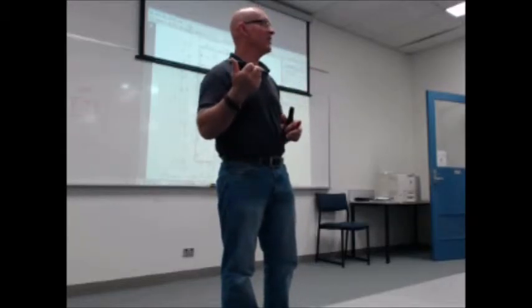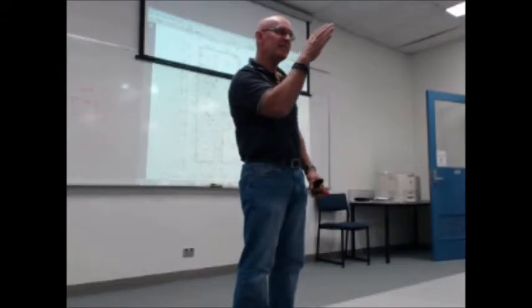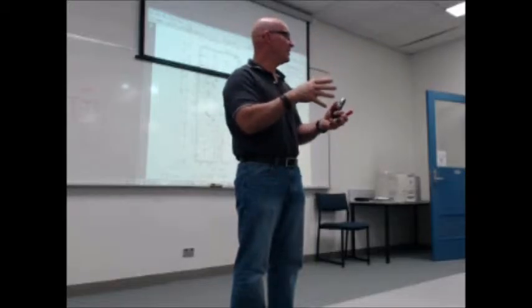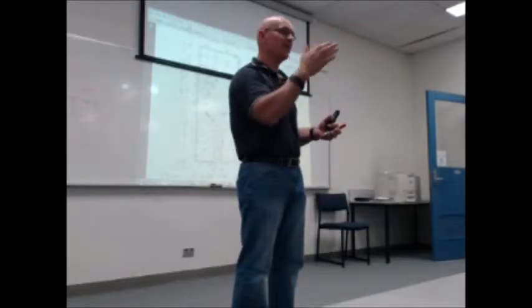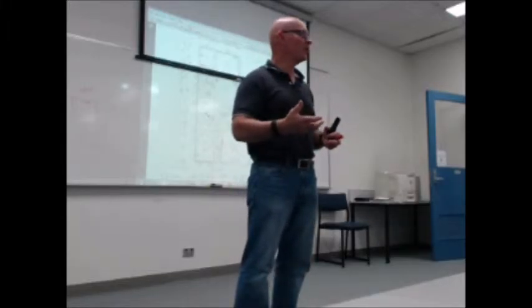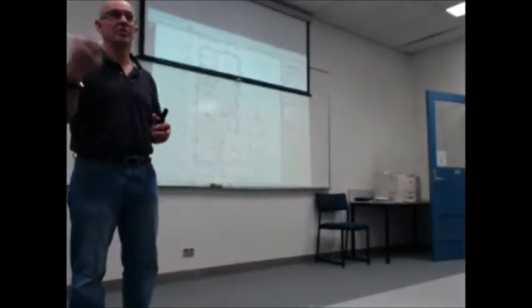And there were spare tiles in the garage and I've gone and looked, opened the box and looked down the edge of one. And that's lipped. Not on every one. So when it was laid, if that tile had the little bend to it, it was causing a lip. Apparently it caused a hell of a fight between the builder and the tile supplier. But that was the logic of it.